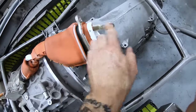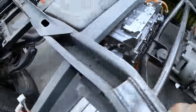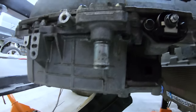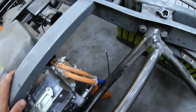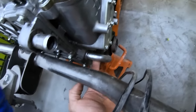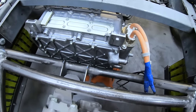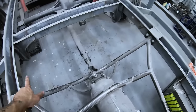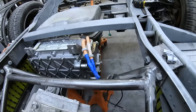We're probably taking the inverter apart since it's detachable - we'll lengthen the wires and assemble everything on the same connector with the length we need. Everything has all the clearances and wire connectors clear, hooked up from the bottom. The water system lines are sorted. Spent the whole day deciding which position was the lesser of evils - something always gets in the way. Still need to come up with a mount, but there are clearances everywhere. It took two full days to invent, fabricate, and install all the mounts.